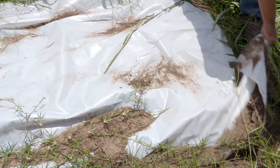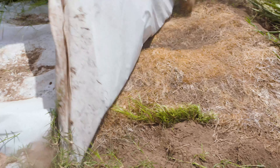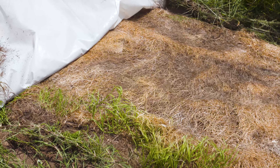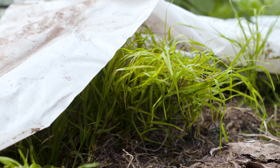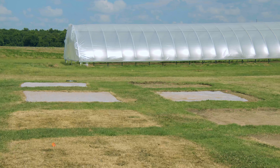It is recommended to use a clear plastic that's anywhere from two to six mil. Because six mil seems to be a little more opaque than we wanted, we're going to repeat this process using two mil, which is thinner. You may have to be more cautious about wind and damage causing holes, because you really want to create a sealed envelope.